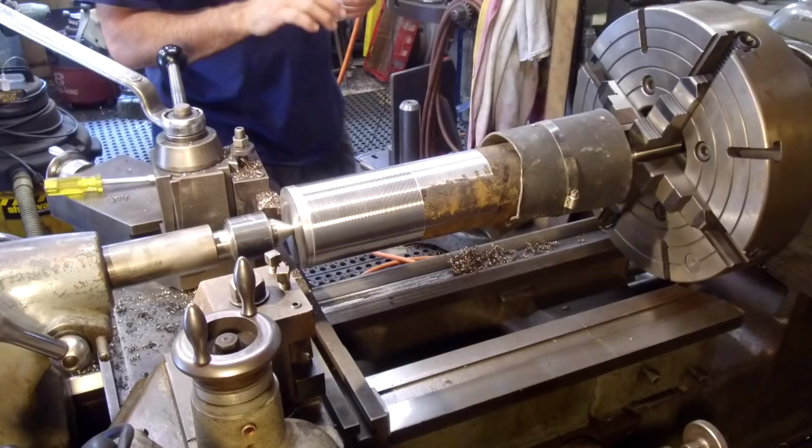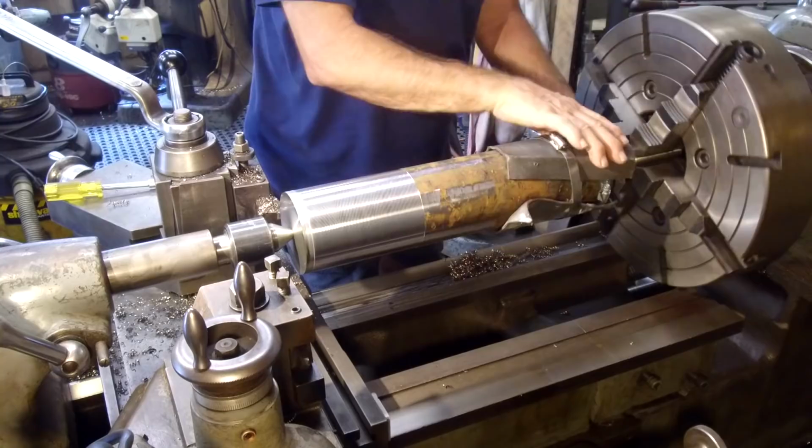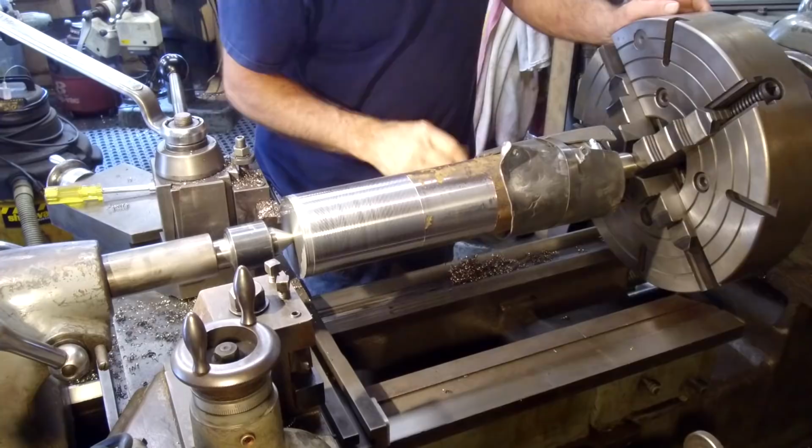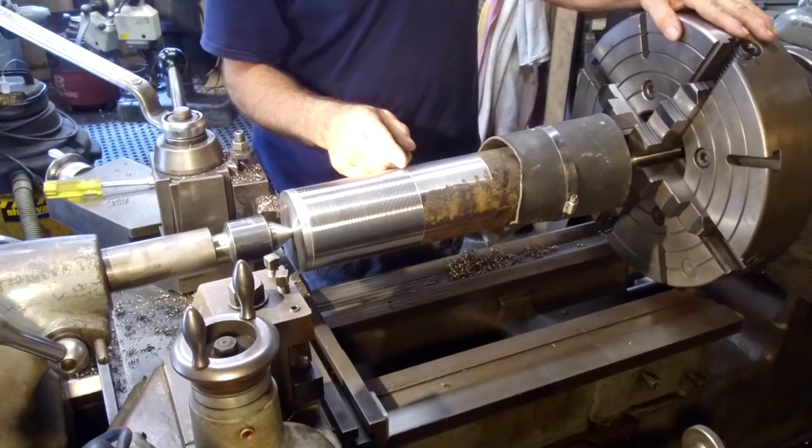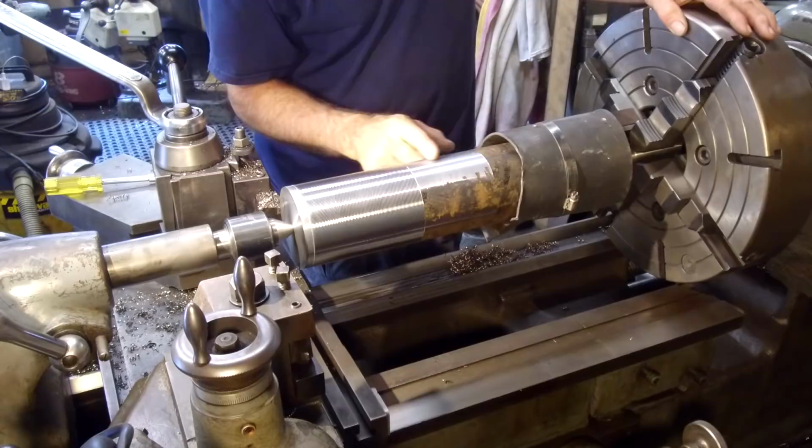All right, I stopped and I reached under my rollaway, and I have some 3/16 thick, or 1/8 thick lead. I think it's 1/8. I did have some 3/16 down there, but it seemed to be too hard to bring around here. So I wrapped this around, put a hose clamp on it, and then touched off where I was having that harmonics really kicking butt. And then I decided to touch in here. Of course, this isn't as deep as this. I wanted to lightly touch in here.